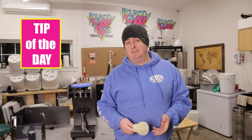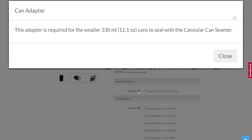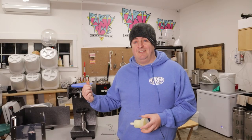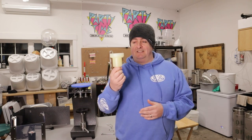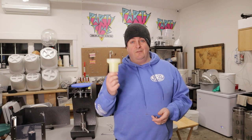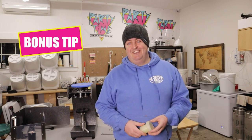Tip of the day: don't buy something on the website just because the company recommends it. I bought the 330 milliliter cans and right next to it they recommended the table spacer for the Cannular. I have the Cannular Pro — this spacer was for the plain Cannular. The Cannular Pro is adjustable; the Cannular is not and needs the spacer for smaller cans. That was 25 bucks down the drain. Bonus tip: the cans will hold 90 PSI but could fail if you're heating them for pasteurizing or storing in a really warm place. If possible, store them in a cool place. If you have to store in a warm place, put a little extra headroom in the can to give it more space to expand before failure.